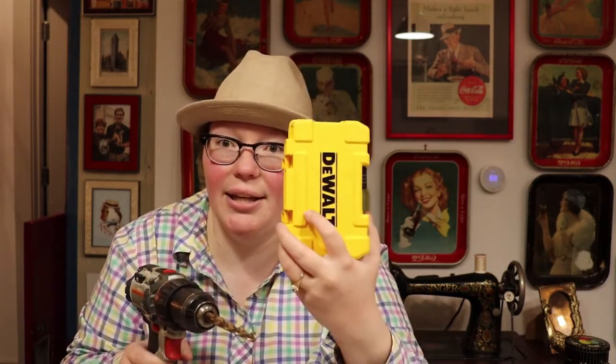You could use a heat gun, but I'm not near my workshop right now. I was able to bring home some tools before the pandemic started, so I have a little tool bag here for small projects. You're going to need a drill — I have a 3/8 drill bit, which is the largest that comes in a standard kit. You'll need that to drill a hole through the camera so the cord can snake out the back. Because this camera is Bakelite, you'll need several drill bit sizes and do it in steps so you don't crack the Bakelite.